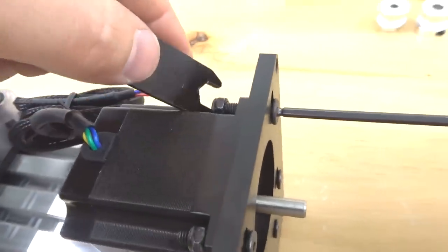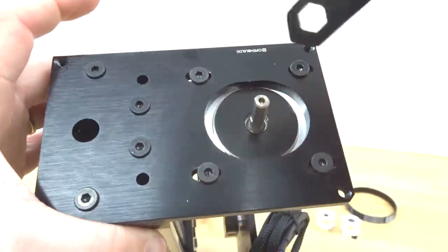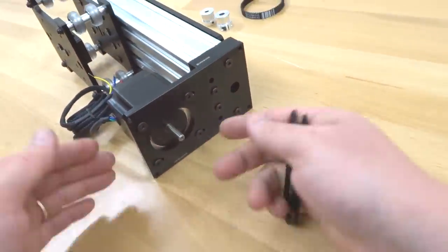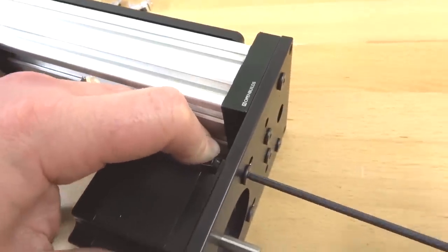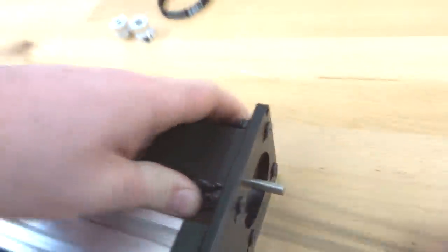Go along the additional three screws and tighten those. Now that we have that tight, let's shift it back to allow tension to be built up between our pulleys. If it's too tight with the screws, go ahead and loosen the bolts. You want to shift the motor back — creating the tension we need between the pulleys. That looks perfect; now tighten those screws down. If you do need to make more adjustments, just loosen up the hex nut and shift that around.